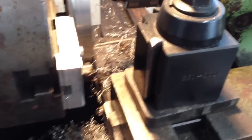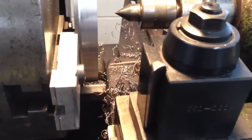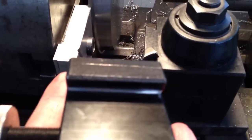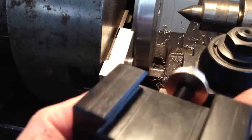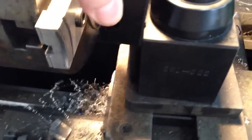Here's a quick fix for the tool post. I had a tool post that wouldn't fit on — it's tight. These are new, I just got these, and they won't fit on there. What I did was take the tool post and inside here I grind down in the root of that right in here. Run the thin 1/16th inch grinding wheel down there and then you can slide this on.